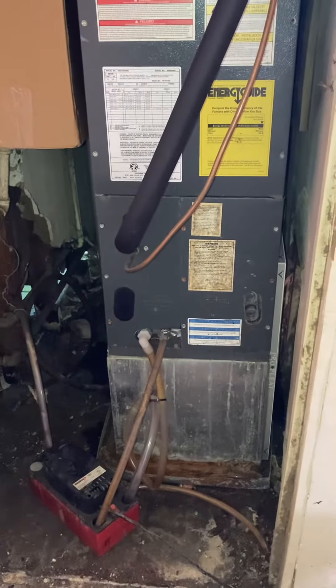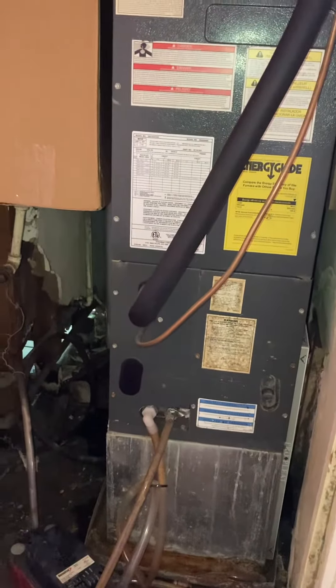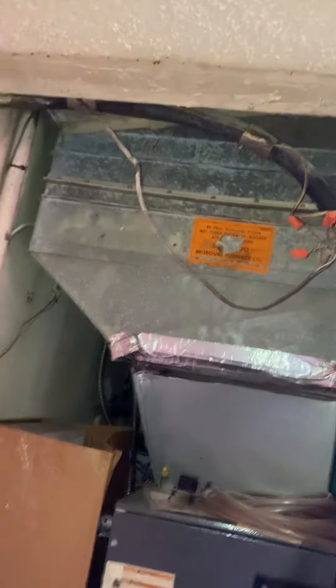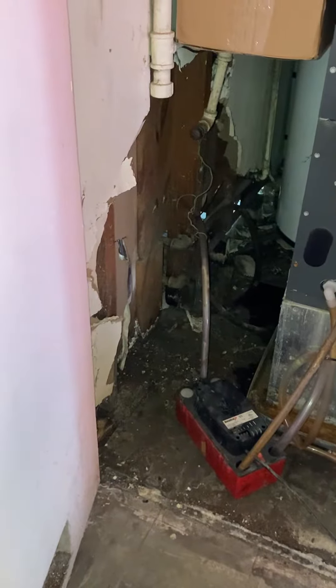There's a filter on the side, and then there's a transition into the plenum. We should have plenty of height for the base air handler and transition into the plenum. There's also a condensation pump — it's connecting into the drain in the kitchen next door.